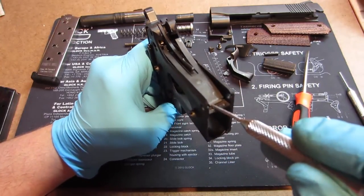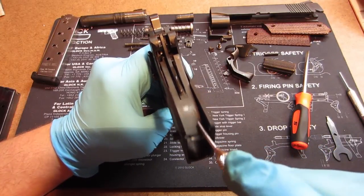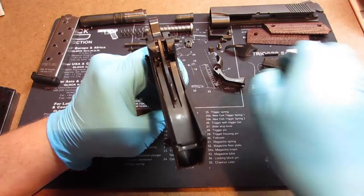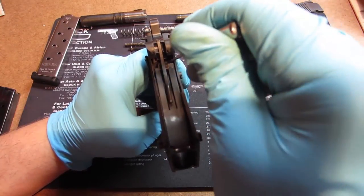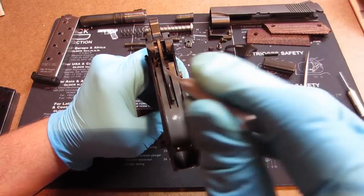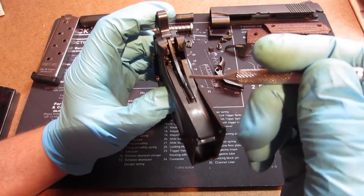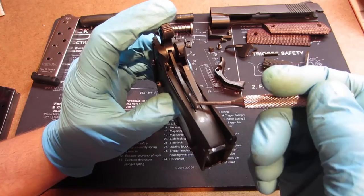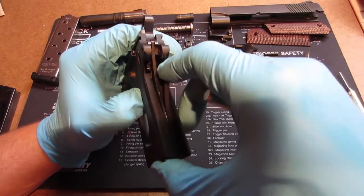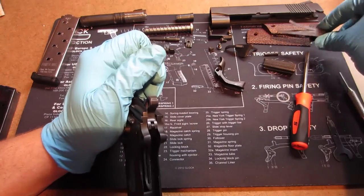Now you should get a good view of the sear spring. This is the sear spring — pretty interesting little design, just a piece of flat metal. There's a registration mark, a little sliding slot right here that it sits in. This right spring is for the grip safety — it's what gives the grip safety its spring. This middle spring is for the release of the grip safety, which the sear up here is pushing against. This one is also attached to the sear. The hammer extension rod rides down and pushes down on this spring. Original Browning design. That's the sear spring.